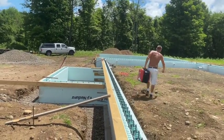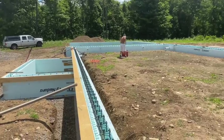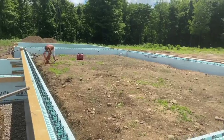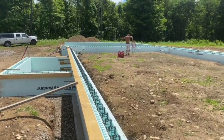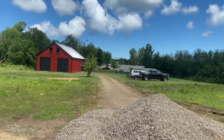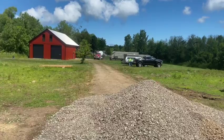Stay with us. It's going to be a nice little pour today — it's about 20 yards. We're using 3,500-pound concrete. There are no fibers in it, but we did put some extra super plasticizer in it and it's got real small stones. We don't want the bigger stones because they'll tend to hang up on things. We are going to internal vibrate everything on this job — some people don't, but we always do. What's that I hear? Oh! Conveyor truck rolling in — Frank, here comes the mud! Get your boots on, buddy, let's go!